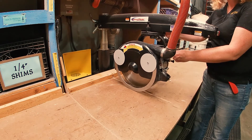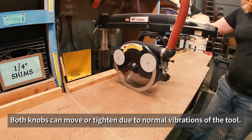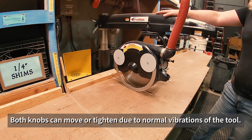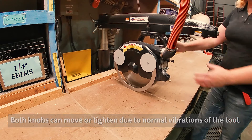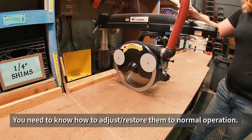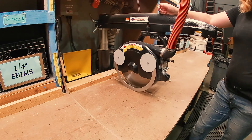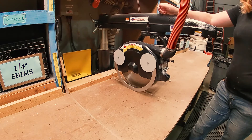There's also a knob on the other side of the saw that locks the saw in place. That is to lock it so you can rotate the head and do other things that we don't really do with the radial arm saw here. We use the radial arm saw basically for cross-cutting and cross-cutting wide boards.